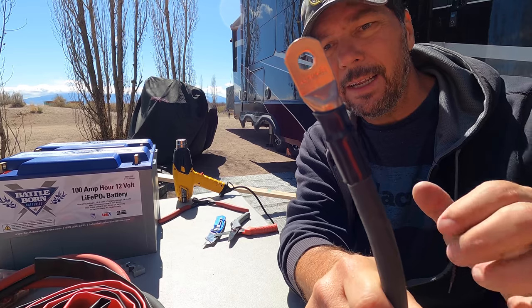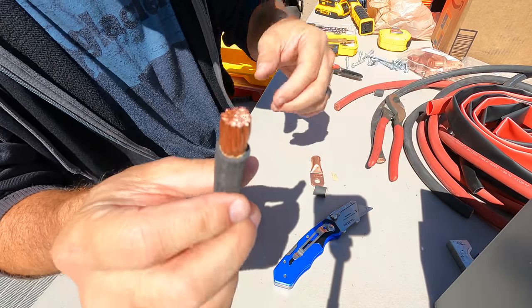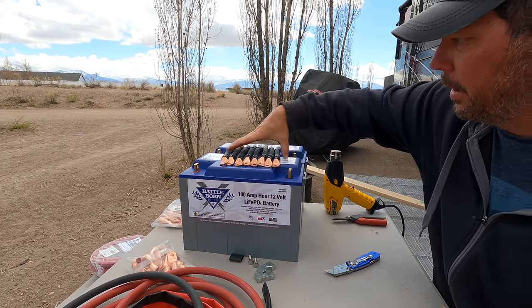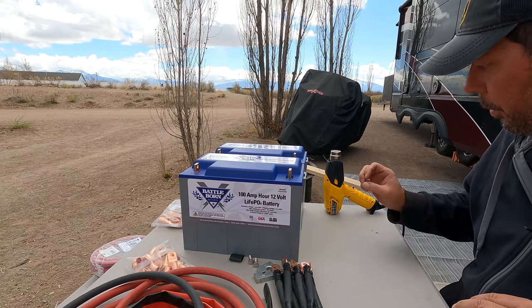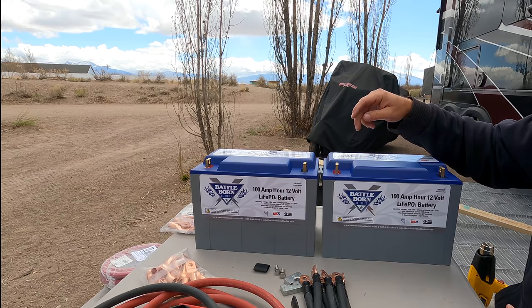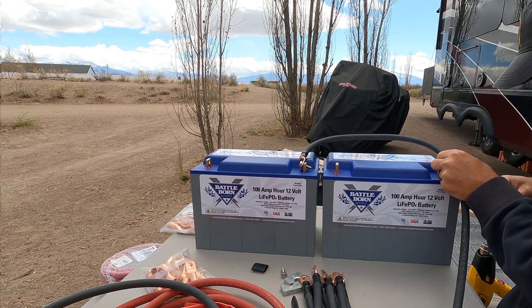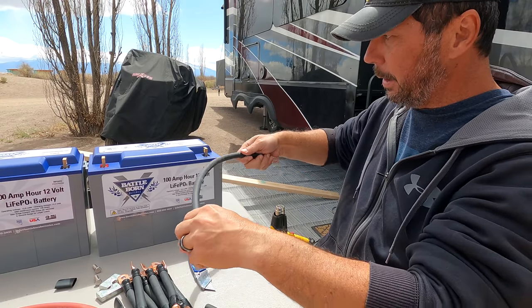Looks good to me. You can see what I mean by the welding cable. Super fine strands. Okay, now I need 7 more like that. I've got my 8 interconnects done. Now I gotta do 8 red ones, but I've got 1 more black cable to make to run the 2 strings of 5 in parallel. I will need to go here to here and here to here. Black to black, red to red. Positive to positive is parallel. For this one, I am going to take into account the bend and twist.